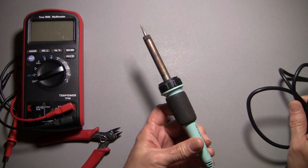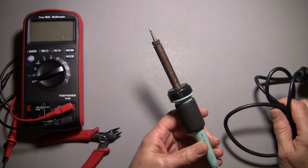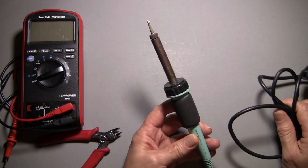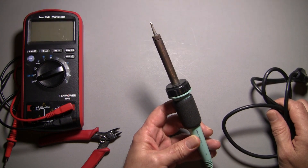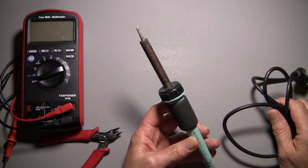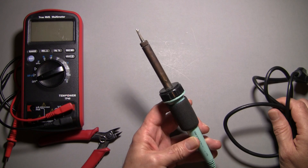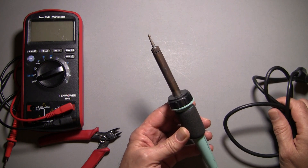The first and most basic kind is your simple pencil soldering iron. The 35-watt Weller used to cover about 90% of the jobs I would do — circuit boards or wiring — for many years. I would not suggest buying a pencil type soldering iron now because what's changed is we now use lead-free solder. Lead-free solders require a much higher melting temperature, so a fixed-temperature pencil iron could damage older circuit boards or components, or melt wiring connectors by applying too much heat.